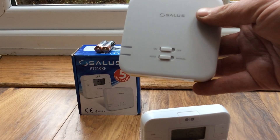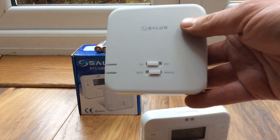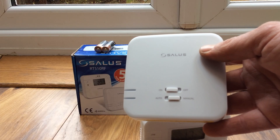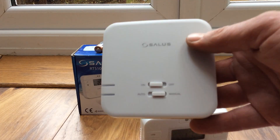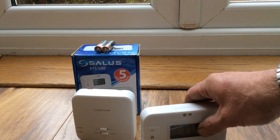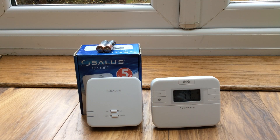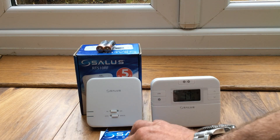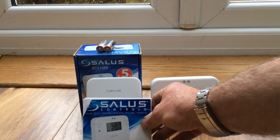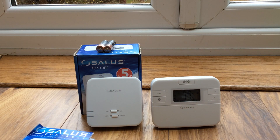If you have this unit and your heating doesn't come on — maybe the batteries are gone, you've mucked up the program, or whatever — just set it to manual and your heating will come on. You'll get a green light and your boiler will come on. Leave it on for an hour, turn it off for half an hour — it will just stay on all the time. If you like this video, give it a thumbs up, comment, subscribe and ask any questions you like. Good luck with your thermostat, cheers!